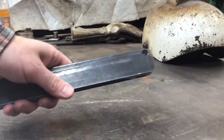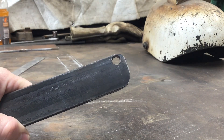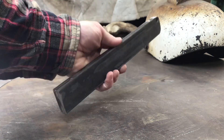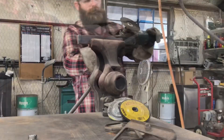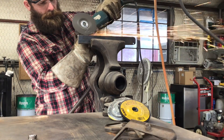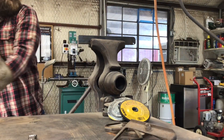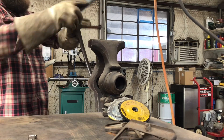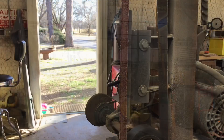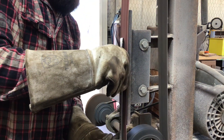The design on this is pretty simple — just some flat steel. We're going to have a bolt and then some bearings. The bearings are going to be 7/8ths on the OD and 3/8ths on the ID. What I've done is taken a couple pieces of inch-and-a-half by quarter flat, welded them together, drilled a hole out towards the corner. Now I'm cutting them back apart and we're going to clean them up and get ready to assemble this.